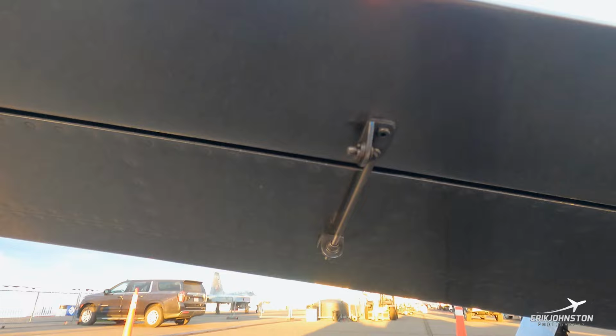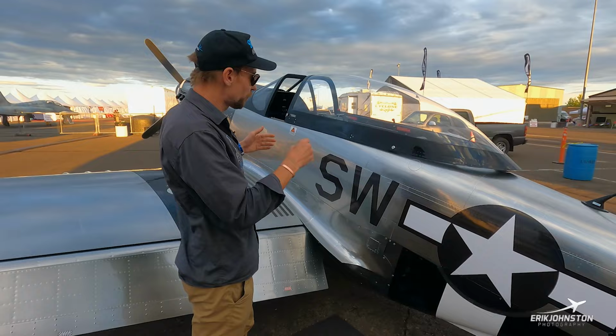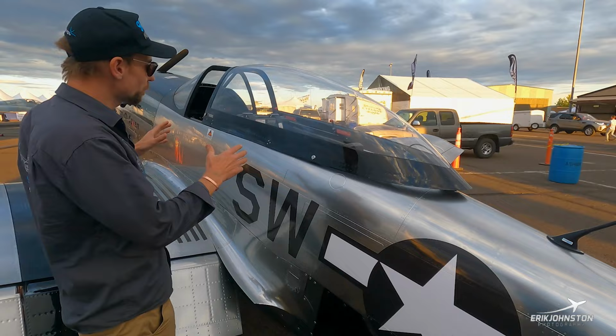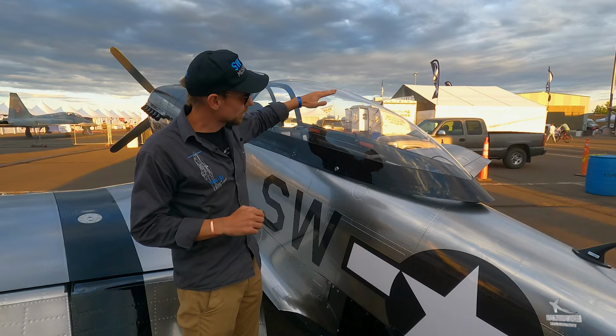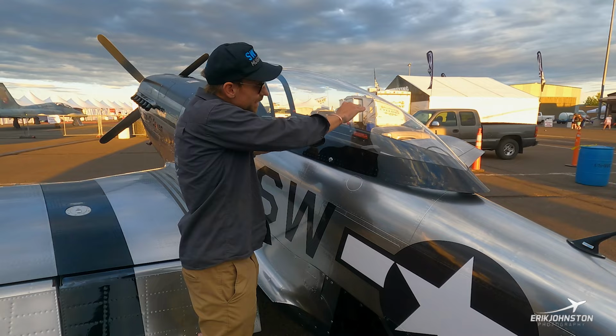Okay, I think we have talked about the outside. Now let's move to the inside. Before we move into the interior, one more word to the canopy. The canopy is slightly modified. We modified it in a way that we stretched it a little bit to the aft because this one is a real double-seater in a tandem configuration. And so that both pilots have the ideal view, we've made it a little bit longer. That means you can go up a little bit higher, which is improving your visibility.